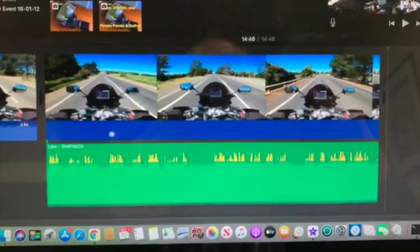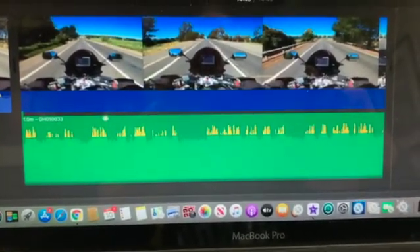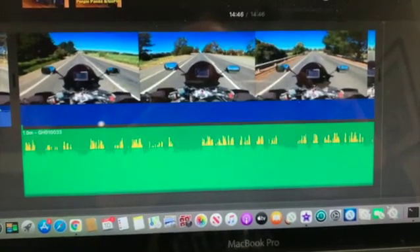Looking at the audio from that run — with the audio detached in iMovie — you can see it's peaking into the yellow once we got up to speed with wind noise, but we're not going into the red. So we're not hearing those pops and crackles caused by overloading. That looks like it's worked. While there's nothing wrong with the Purple Panda microphone — it's a great microphone — in my case with wind noise at speed on the motorbike it was overloading, and that little DIY attenuator seems to have fixed the problem. If you like the video, please click like and subscribe. Thanks for watching!